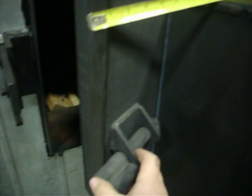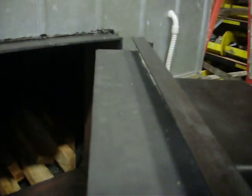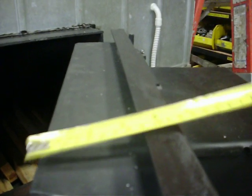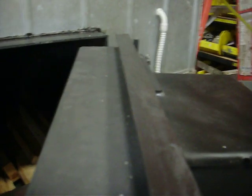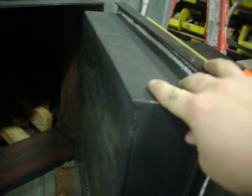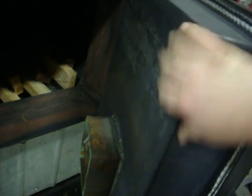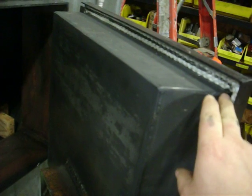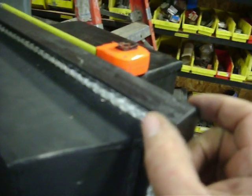You're looking at about four and a half inches in the front here. This part is about three-sixteenth, this is quarter inch, and this whole thing is filled with ceramic insulation — good for like two thousand degrees. There's your seal right there.